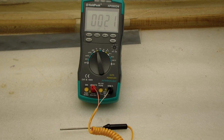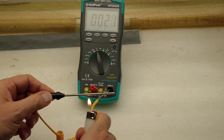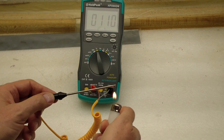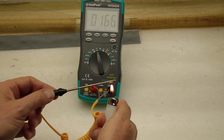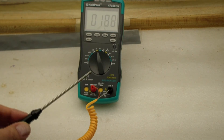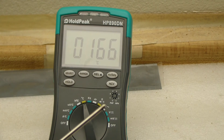Now we can try the temperature sensor. It seems to be reading a very likely temperature — 20, 21 degrees Celsius. Let's give it some real temperature. It starts going up: 24, 35, 45, 70, 90, 110, 140, 160, 190 degrees. I turn off the heat and it starts cooling down. That part seems to work — Type K thermocouples are supposed to be very accurate.